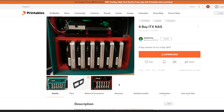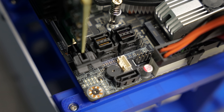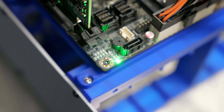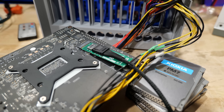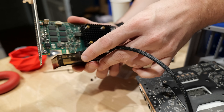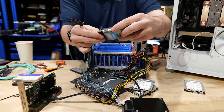Look at this motherboard — it's got so many cool quality-of-life features, like the little LEDs in the corner to indicate what's going on. Now this is an X8 interface, and it has two X4 interfaces for M.2. One of them I'm taking to a breakout to a SAS controller, and that SAS controller will support up to 16 devices through eight PCIe lanes. I'm only using four PCIe lanes, but it works really well with this platform.